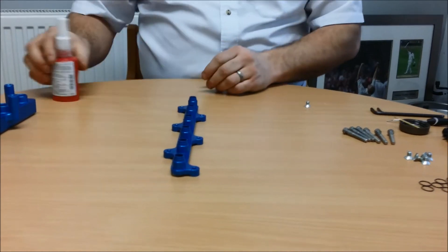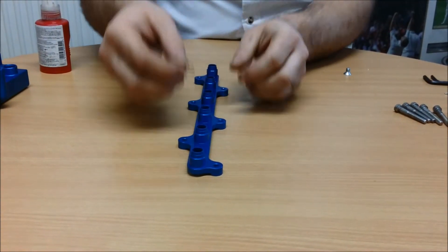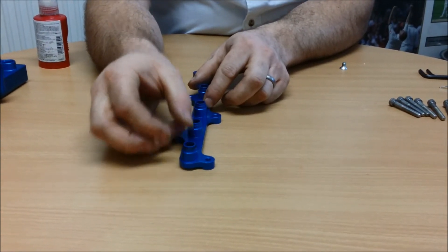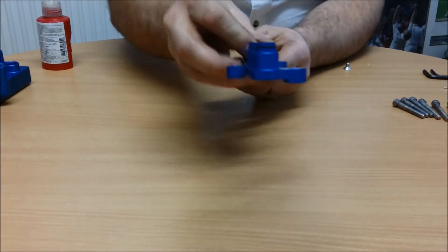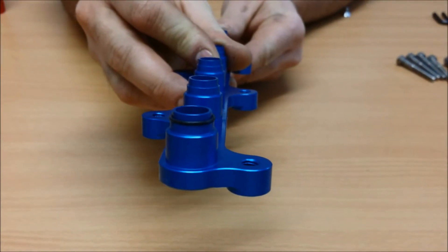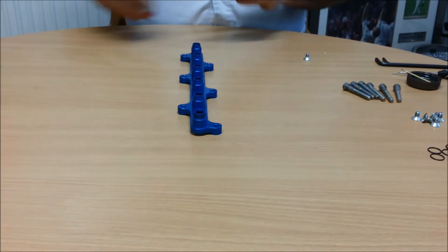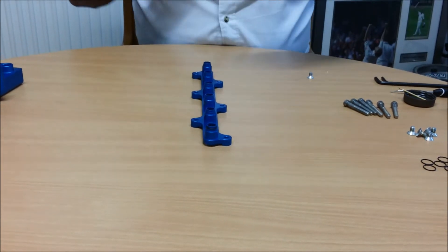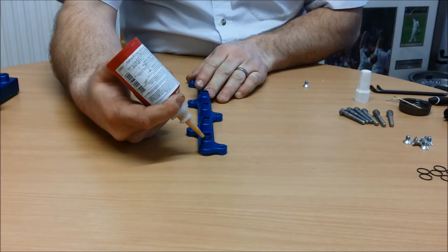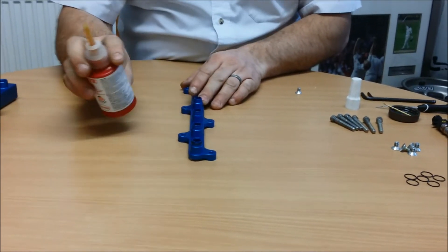Start off with the base plate. You will need to fit each of the o-rings over the first — they have a little lip that they sit on. Do that for all six locations, then add a small bead of your combined sealant and thread lock all the way around the o-ring, which will act as a sealant for it.